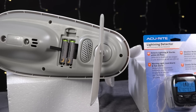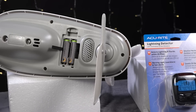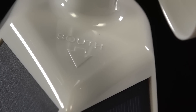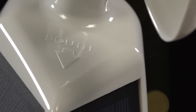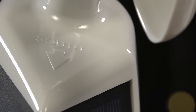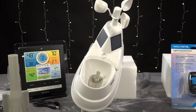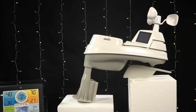Here's a look at the bottom of the whole thing. There is a control inside — before I put those batteries in I probably should have given you greater detail on that — but it has an A, B, or C channel. I set this to the C channel because I have more than one of these out there; I have another one on A. South is marked right on top so that the solar panels face south, which exploits the sunlight. It also has to point specifically south because that's your wind direction indicator that's going to be feeding back to your display unit.